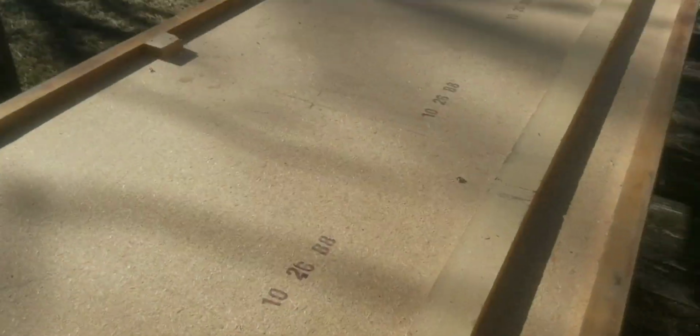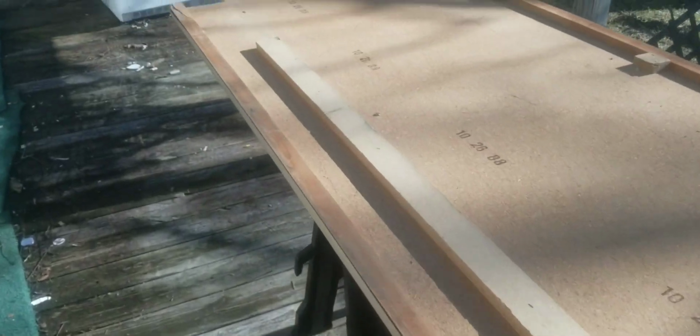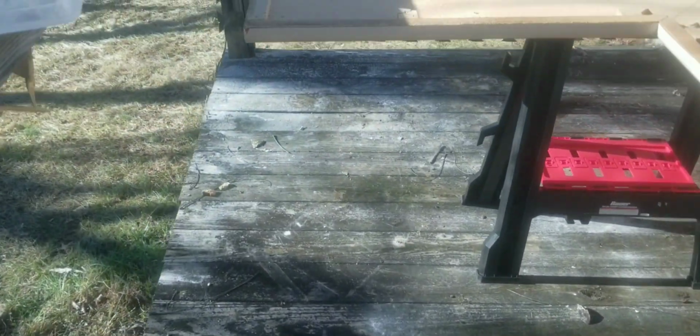All right, so with this countertop here, I don't know if you can see this. It's awful dark on my screen. Anyway, I've got to take off this 6 inches just about right to here, all the way across. In doing so, I'll be removing this right here, which is actually what keeps it level from here to these blocks. Okay, it doesn't sit on this. So my plan is to cut it down to size, take off 6 inches, cut this other down here to the end. And I'm taking out all these blocks. This will be gone because I'm cutting it. But this piece over here, I'm taking this out so that this will sit right on top of the cabinets.